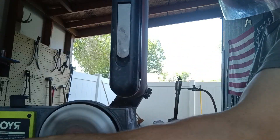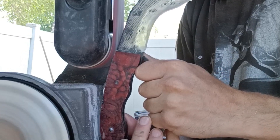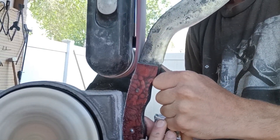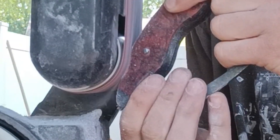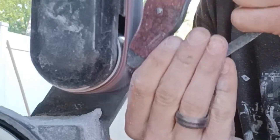We're going to fire up the 4x36 and start hogging off all the excess on the spine with a 120-grit abrasive shredder belt from Combat Abrasives. We're also going to give it some shape on the base to form a secondary grip on the bottom section. It's going to be a long handle with two grip points — one high, one down low for choppy chops.